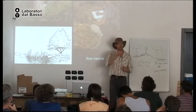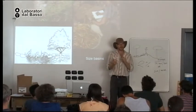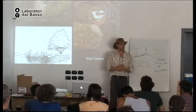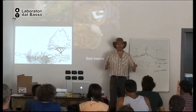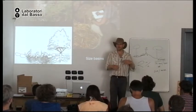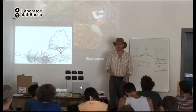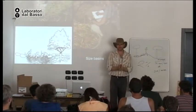The reason we fill the hole three times is we are trying to mimic the worst case scenario. Let's say it has rained for weeks and the soil is full of water, and you've been doing laundry all day, and now you're going to do more. Can the soil still absorb that water or not?